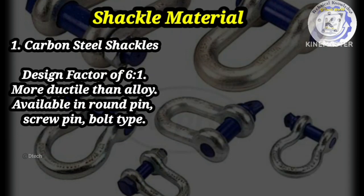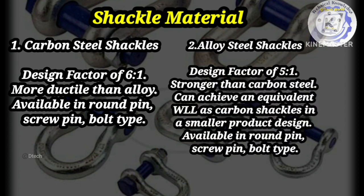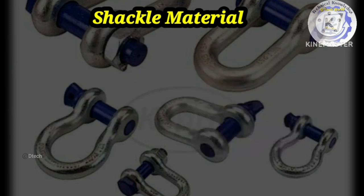Shackle material. 1. Carbon steel shackles. Design factor of 6 to 1. More ductile than alloy. Available in round pin, screw pin, bolt type. 2. Alloy steel shackles. Design factor of 5 to 1. Stronger than carbon steel. Can achieve an equivalent WLL as carbon shackles in a smaller product design. Available in round pin, screw pin, bolt type.